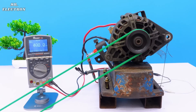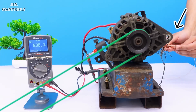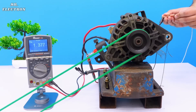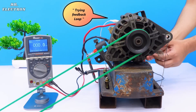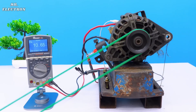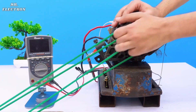Time to turn it on and then connect the Duracell once again. It is generating 1.5 volts without any proper results — seems like I will have to do one more change and see what happens. Voltage goes to zero, and then — finally it has been excited! You can see it is flashing around 11 volts. This is what I have been waiting for. Time to connect one more belt because there was belt slippage preventing me from achieving the rated voltage.